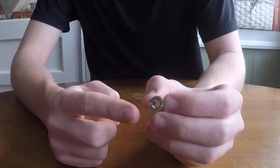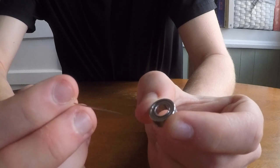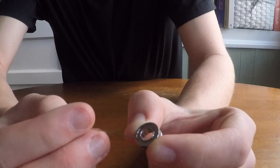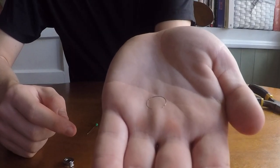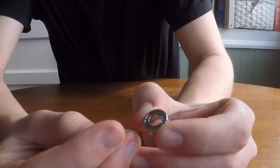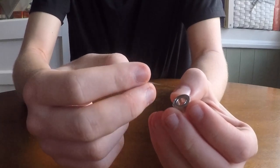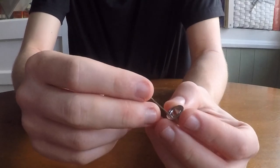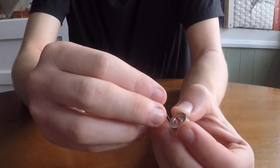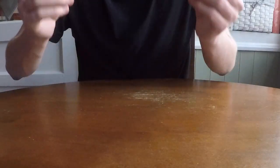So we have the bearing here, and the next step is to remove the bearing shields. There is a c-clip on the outer edge of the inside of the bearing — that's what you're looking for. This clip is lodged in the bearing and holds the shield in place. Right above where I'm pointing the pin, there is a gap in that c-clip. Take your needle, find the gap, wedge the pin underneath one of the ends of the c-clip, then push the needle up and towards the outer edge of the bearing, and the c-clip should pop out.